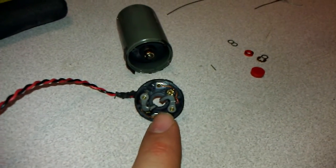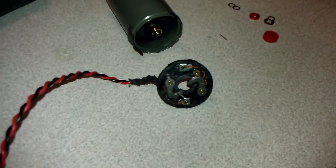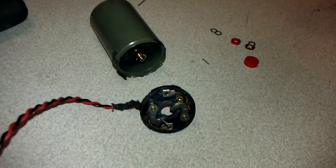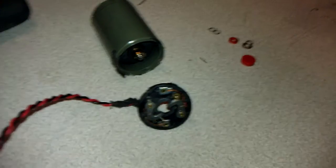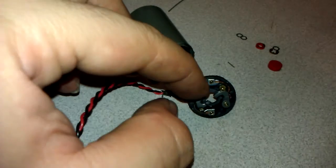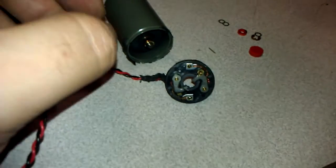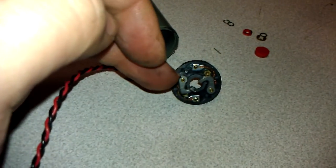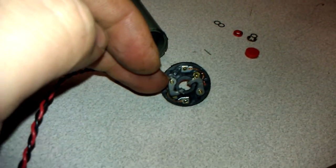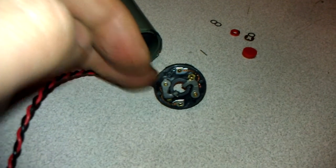First thing I noticed: these curved brushes. This motor is made to operate both alternately in reverse and forward, which normally kills brushes. I'm guessing this was their attempt to prevent the brush from shifting and developing an uneven contact profile on the commutator. They're attached with a little bronze pivot — actually a very tiny oilite bushing, I suspect. Told you they're hardcore.